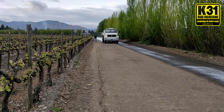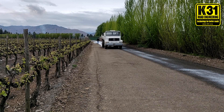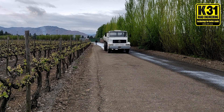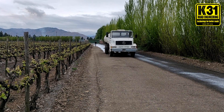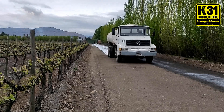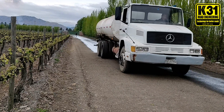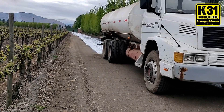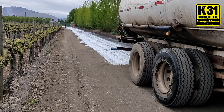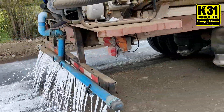You're going to calculate 0.5 liters per square meter divided into three passes, mixed with water at a ratio of one part APS to nine or ten parts water. You don't want to make it too thick and you don't want to do a single coat only — because this is an acrylic polymer and it will solidify on the surface, become sticky, take forever to dry, and won't be able to penetrate into the soil to create proper protection. You want the APS to go into the small crevices in the soil and then seal.